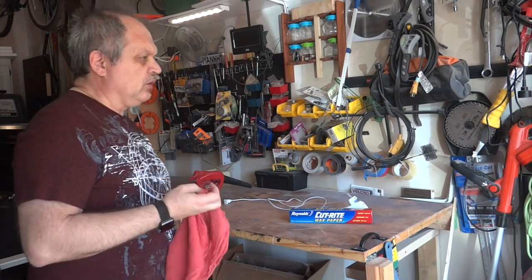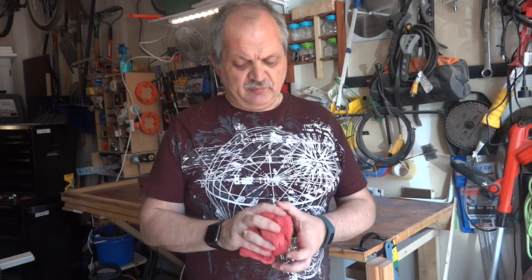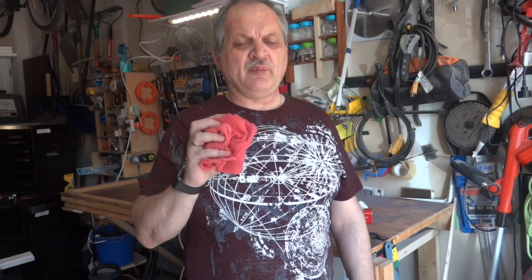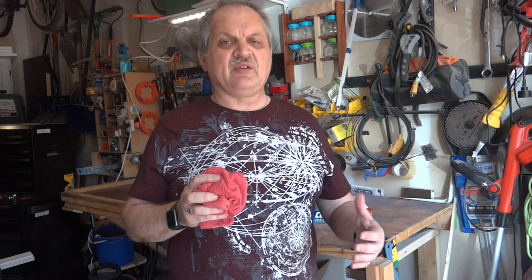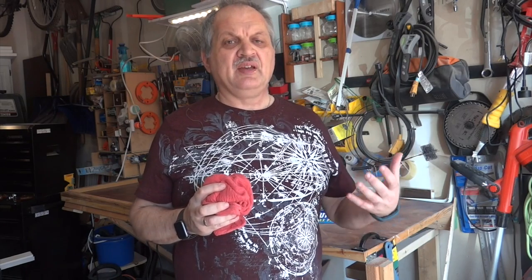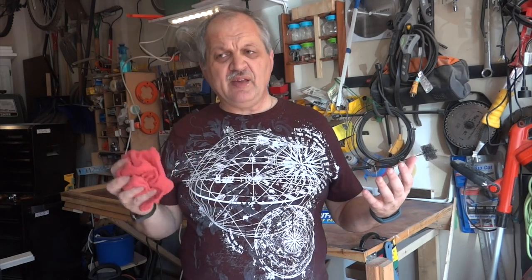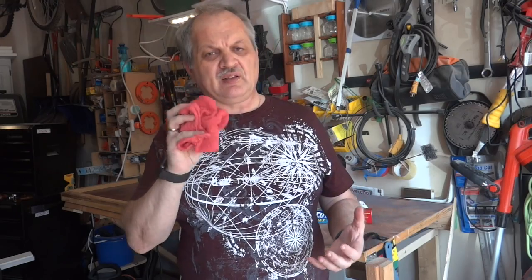Another item that I always like to have. Contrary to a lot of the advice that you see on the web, do not use a wet piece of material to clean wood glue. Instead, use a dry one. If you immediately wipe the glue, then the white piece of cloth will leave absolutely no marks, and also will not do anything to the wood that might change its characteristics, and therefore if you stain it or paint it, you will not see a difference. When you wet the glue, it gets into the fibers, and there are subtle changes that happen, and if you do not wait for it to be completely dry and at exactly the same moisture content as the rest of the board, you're going to actually see marks and you will not know why. So use a dry instead of a wet cloth to clean your glue.